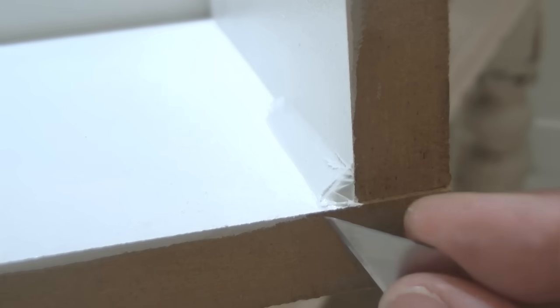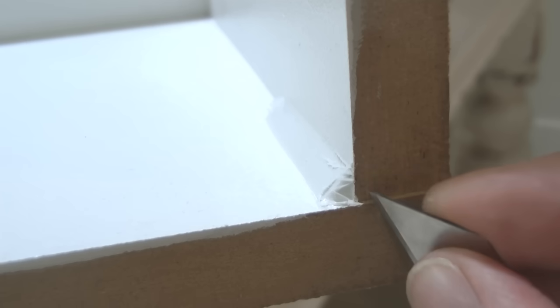It's not so easy to do that where, like here, in my situation, you've got a nice clean joint with no gaps underneath it. But you know, if you are worried about this, then you could select a low modulus silicone, which is a more flexible silicone, which will be much more accommodating and flexible if there is a bit of movement between your walls and, say, your shower tray.